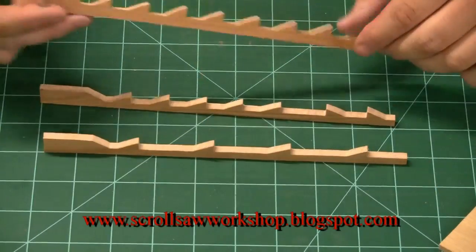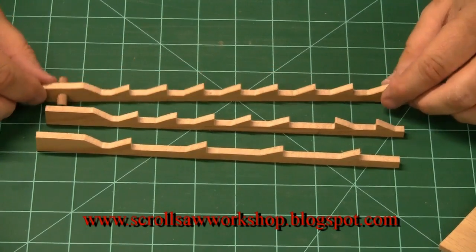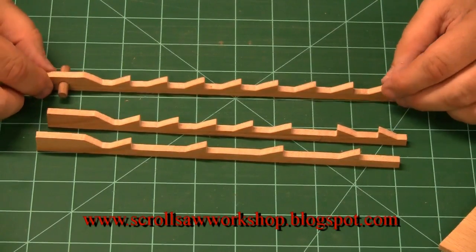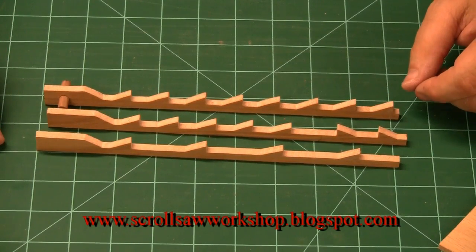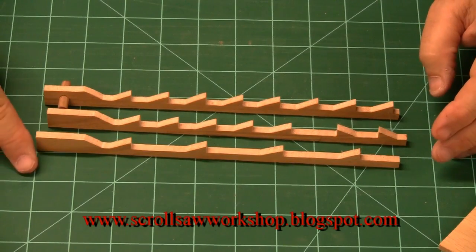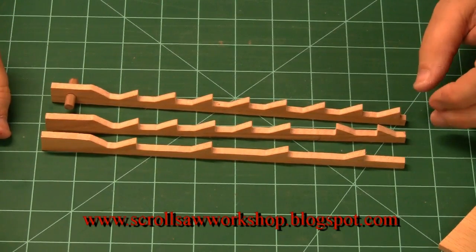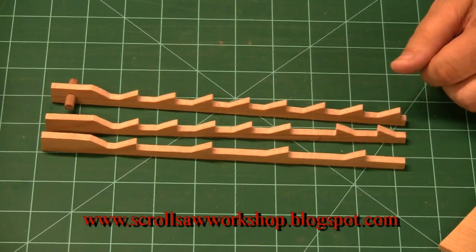So if you're going to cut portrait patterns, you will need some spiral blades. Another exception is if you plan to cut metal, plastic, or glass — you're going to need specialty blades for those different types of materials and you'll want to do your research into that type of blade. The designation is very similar for those blades except for the spiral blades, so once you digest this material you shouldn't have any trouble picking those out.